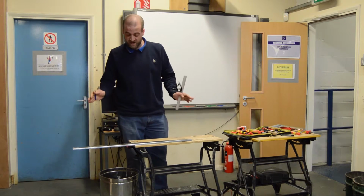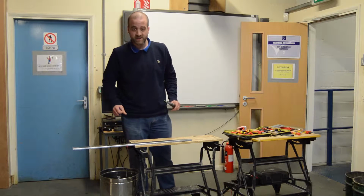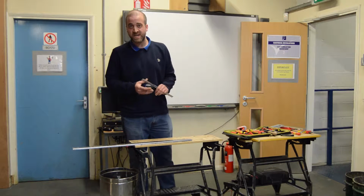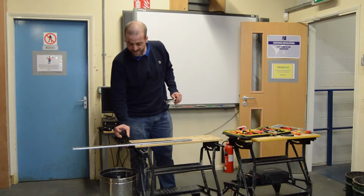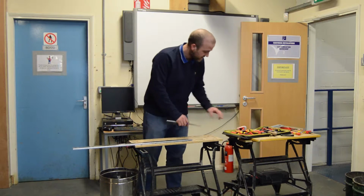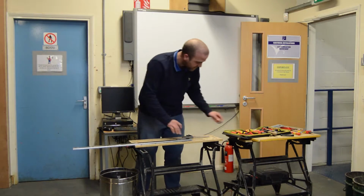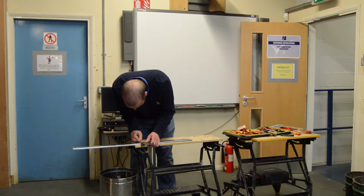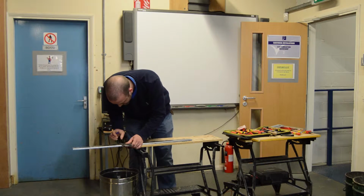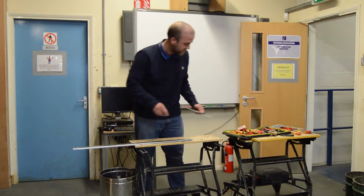And now we're going to draw two further lines outside of this bend, and they're going to be 70mm either side of the bend. Now there is a formula, if the tray is slightly bigger, to work out the spacings we need. But for the purpose of bending a 100mm tray, it's 70mm either side of the midpoint of the bend. So measure that, mark it, and once again with an engineer square, so now we should have three lines on the back of our tray, two outside and one in the middle.